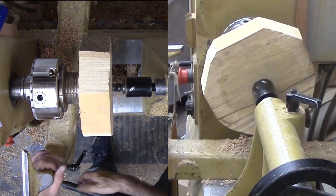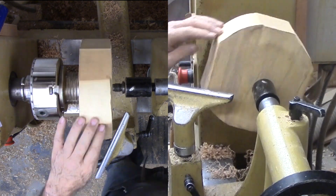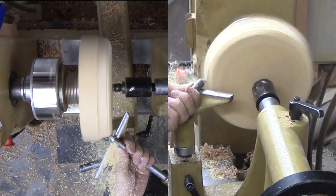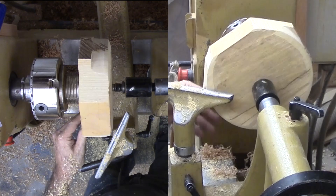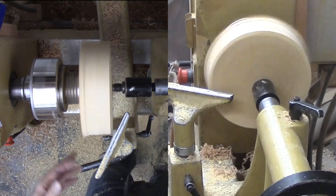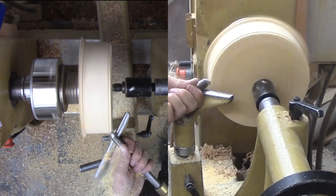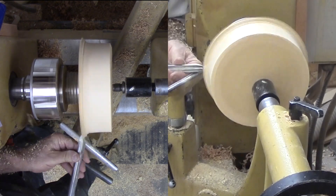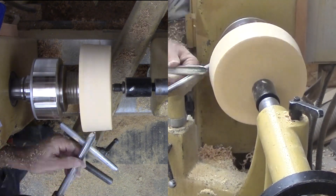When I start to turn wood that has a flat side, especially if the sides are parallel, most often I simply press the wood against closed chuck jaws with only live center pressure. Second choice would be a screw chuck, but that takes time to drill the center hole of the correct diameter. This is quicker and I fail to see the advantage of the screw chuck in this way. In either case, I need a way to mount the wood for the next phase. For now, I will start to round off this wood. It is easiest to cut from the bottom up with the side grain instead of straight into the edge, which would be harder end grain.